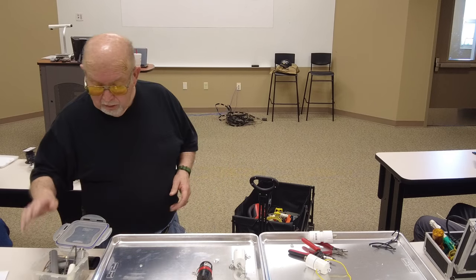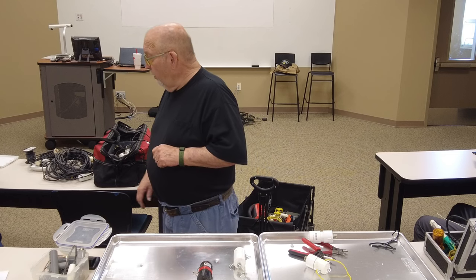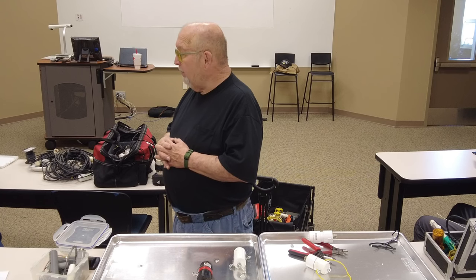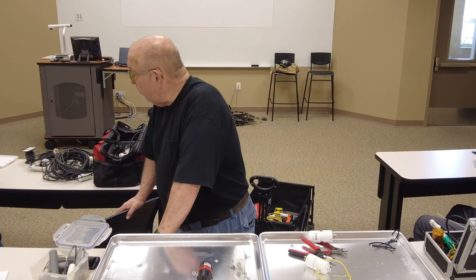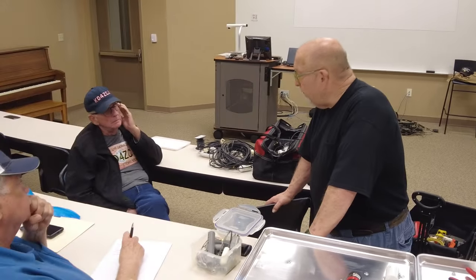Take it on up. Do you still need a balun or an unun or whatever you want to call them for those? Why do you want to use a balun? I'm asking. I don't know. Let me tell you. If you've got RF coming back in your shack from that antenna, then yeah, you might want to put a 1-to-1 balun on it. But if you don't have the RF coming back in your shack, they don't need it. And I'll tell you why.